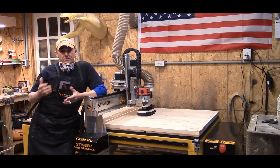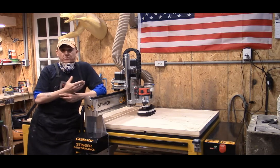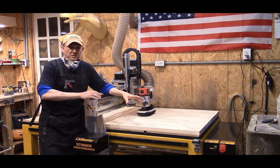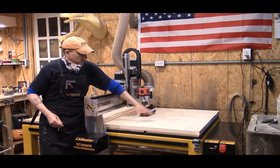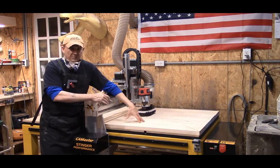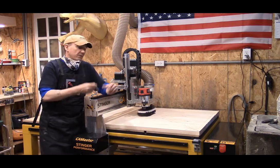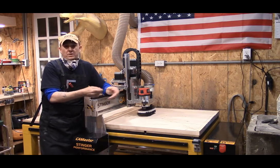We have run both of the backs that were strictly a 2D engraving. Everything we did on the 2D engraving is very applicable to the fascia. Screw your fascias down, take your spoiler board bit after you've done your physical spoiler board itself to make sure everything is universally flat. Do the back side, retract your gantry, get it out of the way, flip the material, and then clear your face off with that spoiler board bit. If you do your cleaning with your face down on the first step, it just saves you a flip — it's one less time you've got to handle the material.